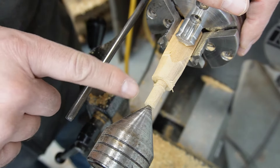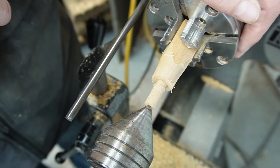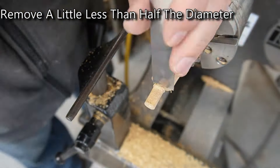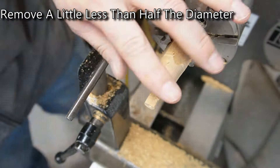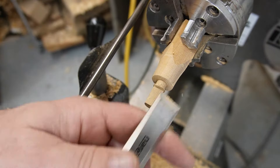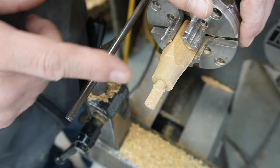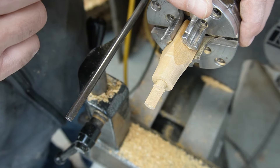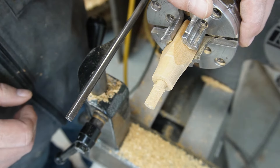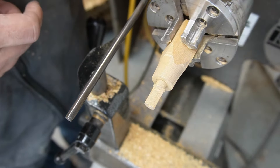For when I slide that in and glue it in place, but for now I'm going to have to take a chisel and take about half of that dowel away. You could have done the same thing by cutting this dowel off the piece and then just taking a piece of sandpaper on a flat surface and sanding it away — either way works perfectly fine. Now that I have this piece ready to go, I'm going to cut this off with a handsaw.